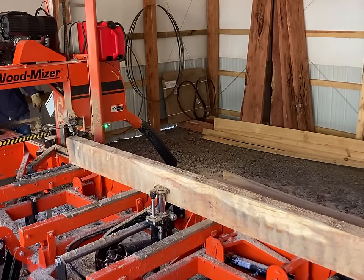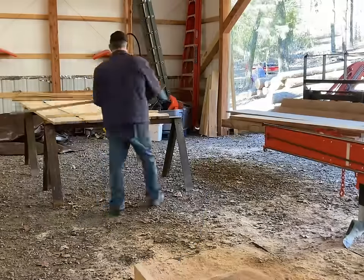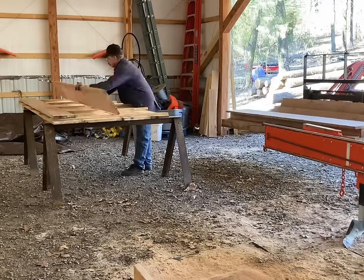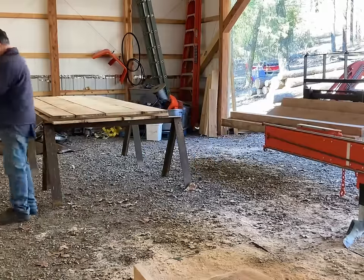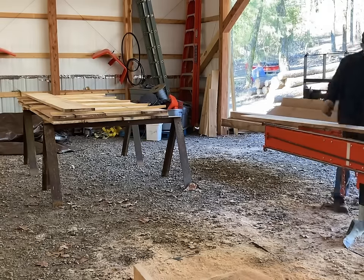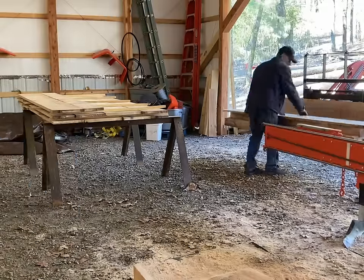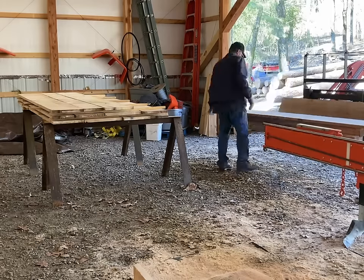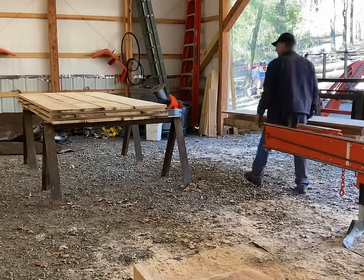Next comes cleaning up and stacking the lumber. I try not to bend my back any more than possible, so I'm bringing it off of the sawmill onto the forks of the tractor, cleaning it up, and then dragging it right over onto some sawhorses. I'm stickering it every 20 inches or so, starting about five inches off of each end. I stack usually three to four layers depending on the thickness and how much water's in the lumber, and then move it with the tractor outside to dry.